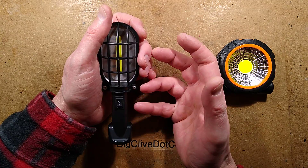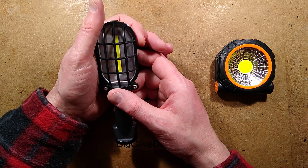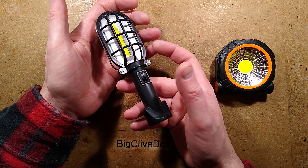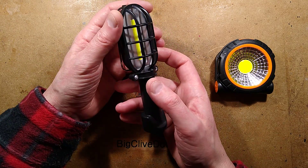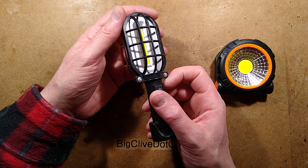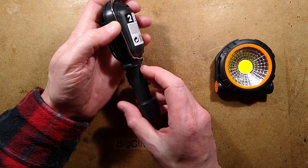When I tested this on 4.5 volts - which would be fresh cells of fairly good quality - it drew 1.5 amps, equivalent to about 6.75 watts. I get the feeling there's no resistor in this. At 3.6 volts with nickel metal hydride it would draw 700 milliamps and dissipate at 2.5 watts. I think this is better suited to nickel metal hydride cells.